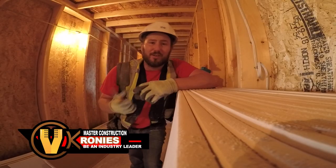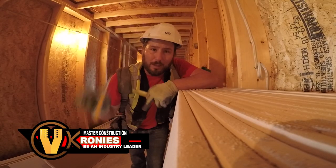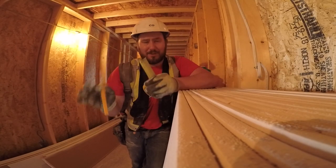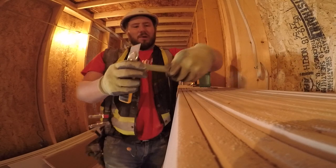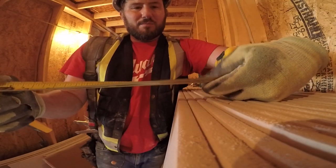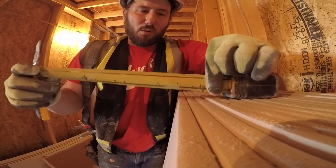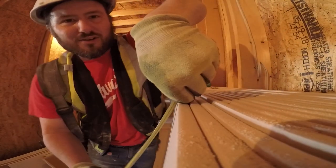For tape cutting it's very important to understand that it's all in the grip. You need to have a good tight grip on your knife and the tape measure. Simply find your mark and pinch it with your index finger and your thumb and keep a hold of it so that you can slide your index along the sheet like so.